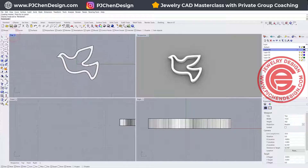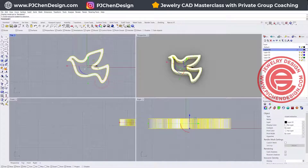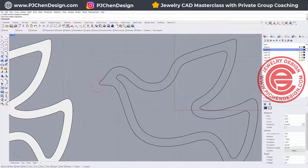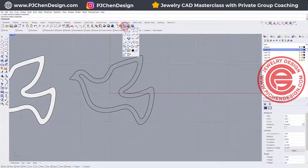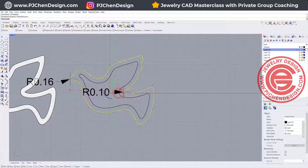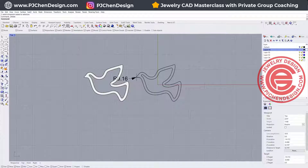So we're going to come back here. One thing we can do is make a fillet. Now fillet may actually cause a problem. Let me move this aside and show you where it might cause the problem. Any sharp point — for example on the beak, or right here — will cause a problem, because if you look at the radius, this radius right here is so small: it's like 0.16 here, and the same thing right here is like 0.1. So anything bigger than 0.1 for the radius will have a problem on this corner.